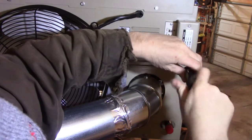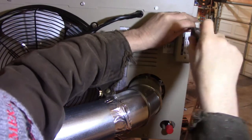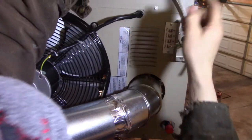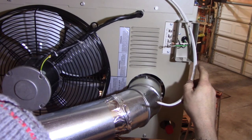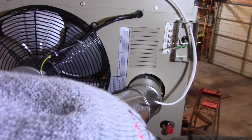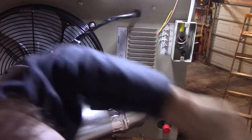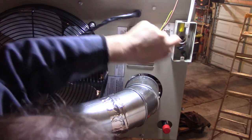I need a better screwdriver — stripping them out. There are just two wires in here, so it'll be easy to wire up. I'm going to run some wire and staple it up on the boards over that junction box. Fifteen feet of wire will do the trick — I'll only go four feet max. I got the thermostat wire run to the wall and wired the unit and put that switch in. Nothing complicated — just basic white and black, with the ground bolted to the back.